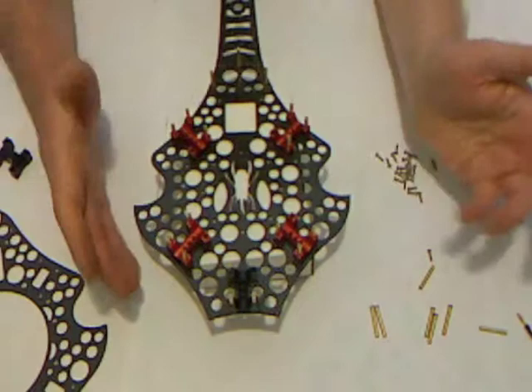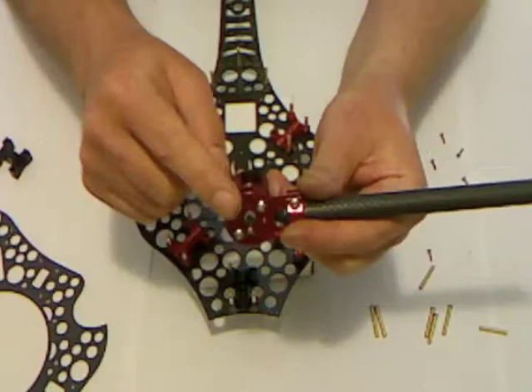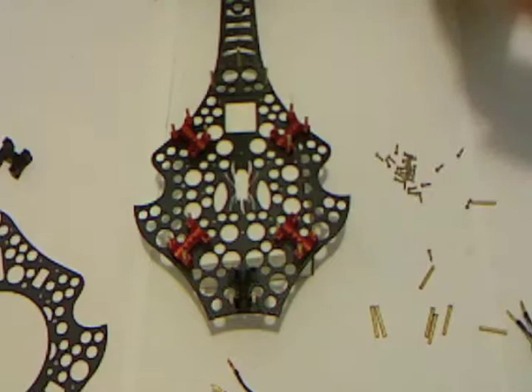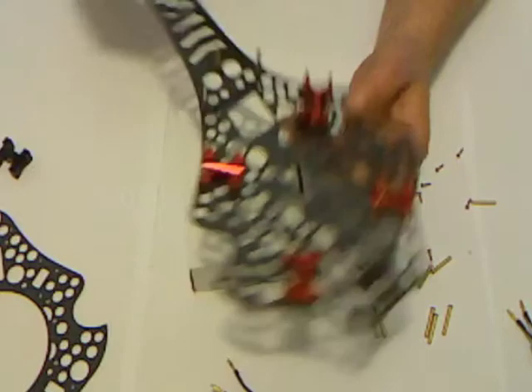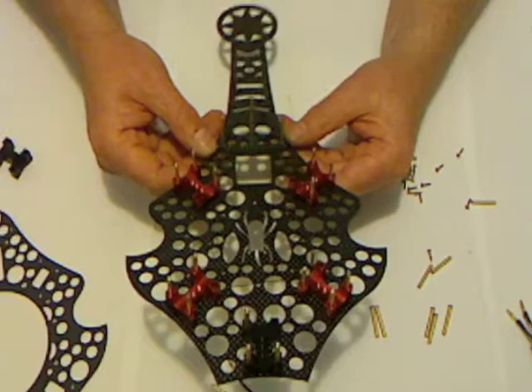Welcome back to part 3 of our Mark III Scarab Recon build. Just to recap what I've done so far: I've made up my four booms with motors, done the Z-bend in the wire in the middle so I've only got short leads hanging out. I've put some white heat shrink on two of them to help visualize the front arms. I've done three pins for each boom mount, three pins for the camera mount block, and also used three pins and three screws through both layers of carbon to attach the extended tail section to the mainframe.